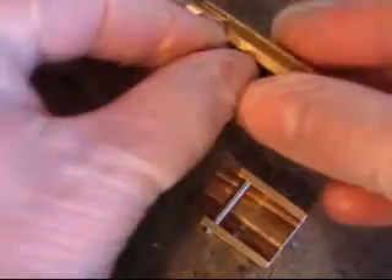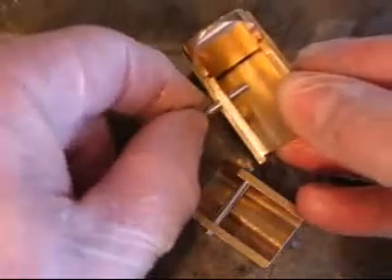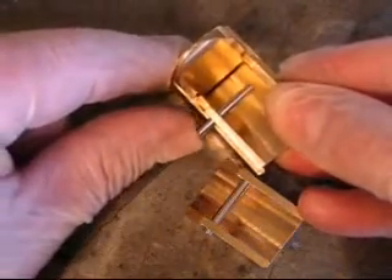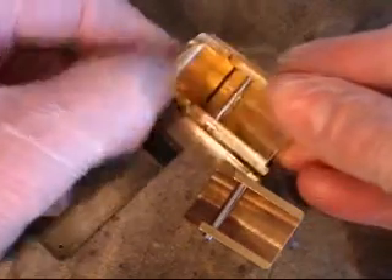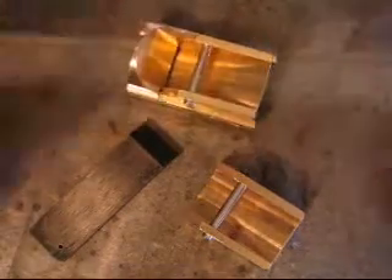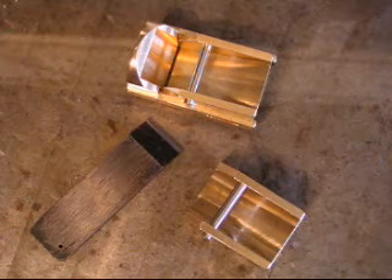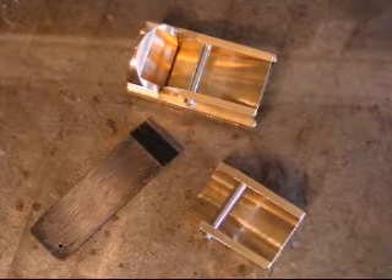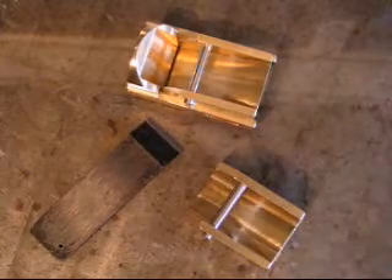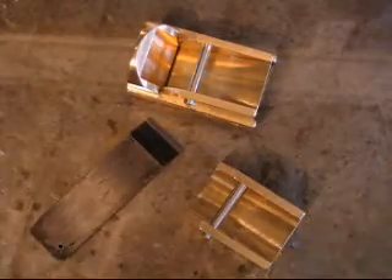There's another one here. They've already been sprayed with the activator. Look at that one — it just will not fall through by gravity. You can feel that the rod is gripped all around its circumference. Just by luck and a little practice and experience, it won't press fully home. When I come to drill right through at the other side, obviously the drill cuts tighter. They're all doctored drills — there's not a single drill I use in the workshop that isn't doctored or modified. For instance, when I drill the two holes in the honing guide for the stainless rods, they're drilled with a 4.7, which actually has the web ground off-centre by just a certain amount. This means the hole becomes a light push fit, gauged by plug gauges for the two stainless rods. That's quite tricky because you must always resist resharpening the drill — once it's cut in right, you leave it.